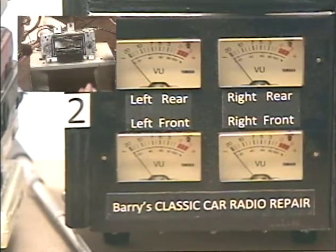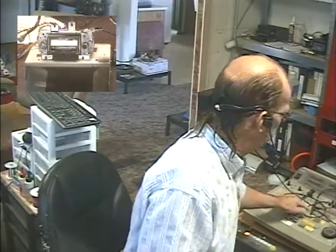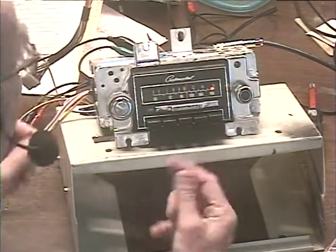Okay, and then now after the aux signal is removed, after you turn off your MP3 player or whatever you do, there is a 20-second delay before the radio comes back by itself. That's due to a circuit that holds onto that aux input longer than it really needs to, just to make sure it's not switching back and forth all the time, like between songs and stuff. So once this radio comes back, there's our radio back.